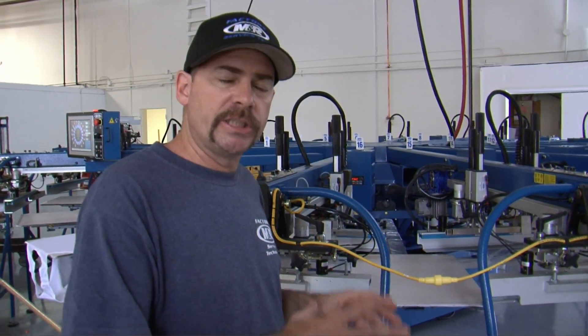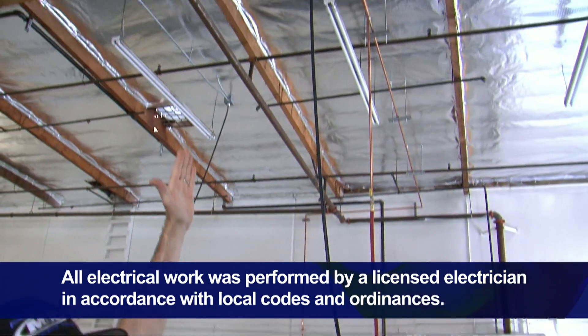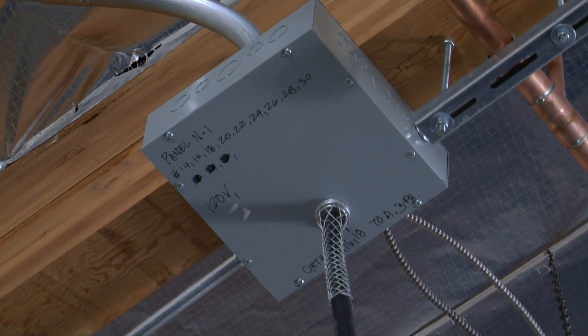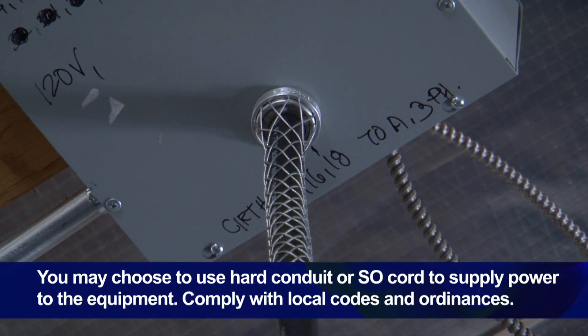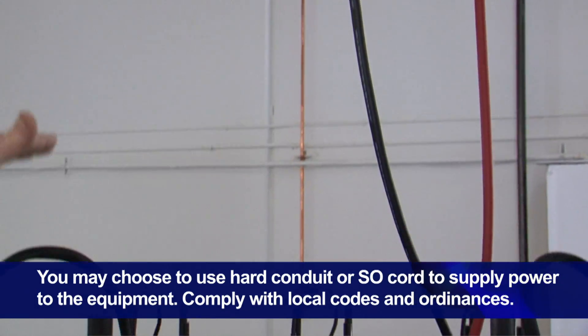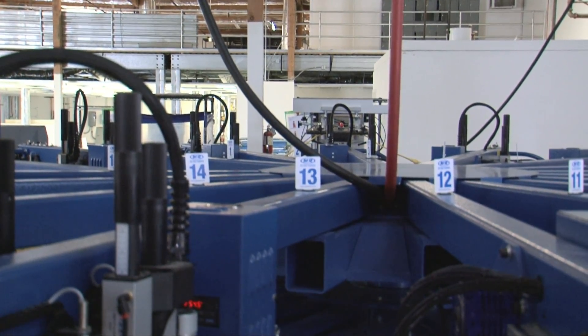This Challenger 3 press has been installed over the last couple days. The electrical work was done prior to the assembly of this machine in this location. The electricians ran the power, mounted the junction box to the beam, and dropped an SO cable using a strain relief up at the top. This cable had sufficient slack to route the cable through the center shaft of the machine and down to the control cabinet on the press.